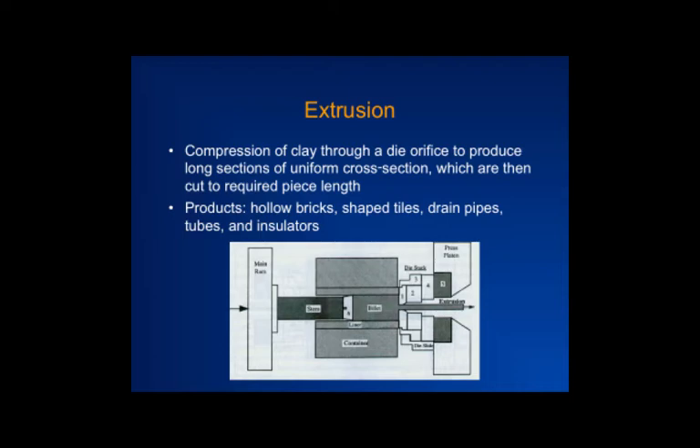You build a block of mixed material, or fill pellets through a hopper, mix them, fill a heated barrel, and a plunger keeps pushing the material through. Depending on the shape of the die cavity you can extrude a part continuously. The key difference from injection molding is that extrusion is continuous — you keep feeding material through and chop it whenever you want — whereas with a mold you fill it, open it, fill it, open it, making it discontinuous.